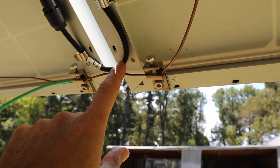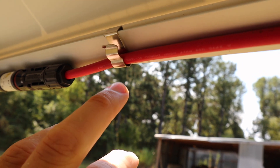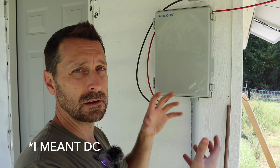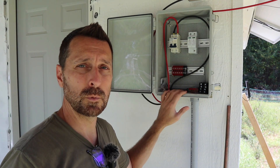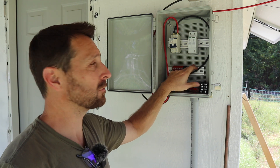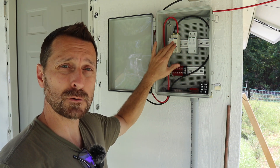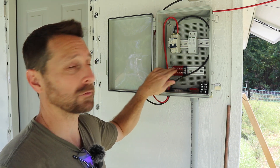You're also going to need to purchase some copper ground wire. For wire management we've got these management clips — only about $5 to $6 for a pack of a hundred. We also do inline fuses on our positive and those are about $8 a piece. Also on the distribution side of things you may need a combiner box. On our other system we have one from Midnight Solar at about $180. This box here was only $50, but we did add some DIN rail pieces — a DC breaker, a surge protection device, and a DIN rail terminal distribution block. The SPDs were $14, the DC breaker is about $23 a piece depending on brand, and the DIN rail terminal distribution block was $30 for all the pieces together as a kit.